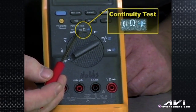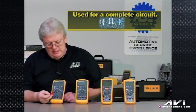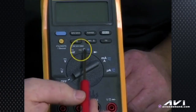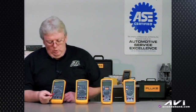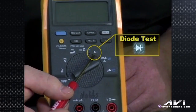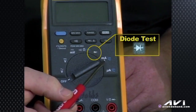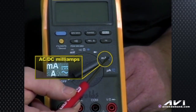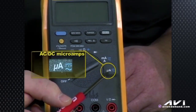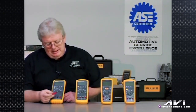If you're looking for a good wire and measure from one end to the other and it's a complete circuit, that's the continuity test. This position is also where you put it to check resistance in ohms and where you'd put it for capacitance test. One more click and we have diode test, so we can check diodes to see if they're open or shorted. One more notch clockwise gives you milliamps of AC or DC, then microamps of AC or DC — one millionth of an amp of AC or DC. That is basically what the knobs mean.